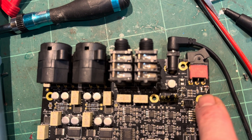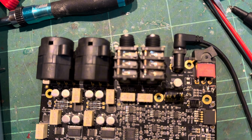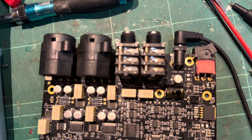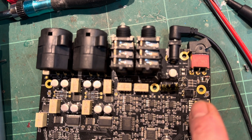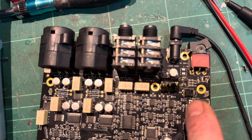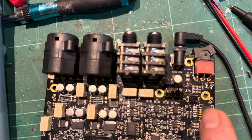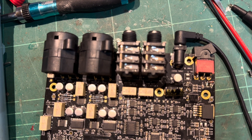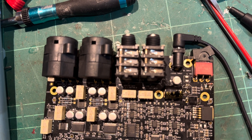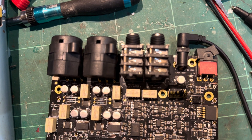I looked around and you can see there's a diode — this big thing here is a Schottky diode. That could have been faulty. I measured across it and it was a direct short, so I lifted one side by unsoldering it. A good way to do that is to add some solder then suck it all off — that gets all the solder off with it. I carefully pried it up to get access to the pins and measured it. One way it was high resistance and the other way showing a value of about 0.2, which is correct for a Schottky, so it wasn't that.